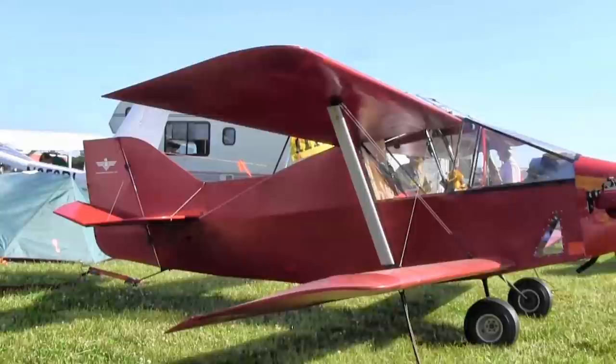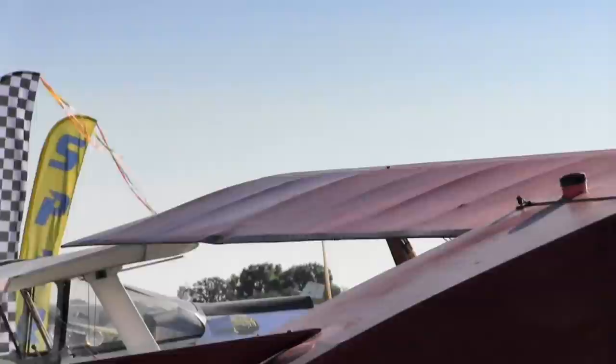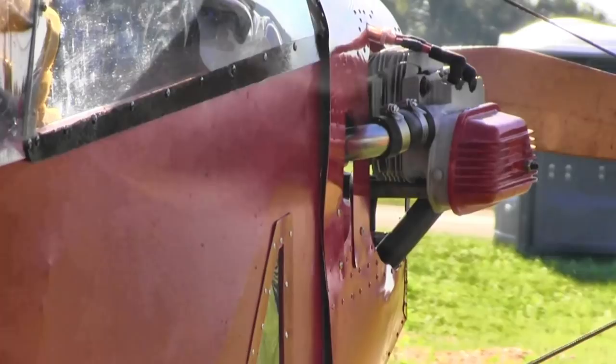It features a two-piece 4130 welded steel fuselage, which can be separated for ease of storage. The aircraft can be covered in pre-sewn Dacron sail cloth envelopes or by the use of standard aircraft covering materials. Building times are in the 150 to 400 hour range, with the conventional fabric covering taking longer to complete. The craft is a taildragger, staggerwing, biplane, in a tractor configuration.